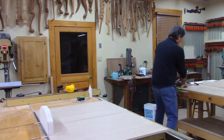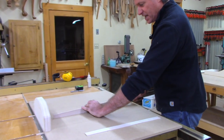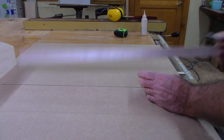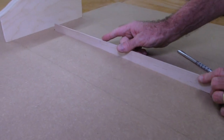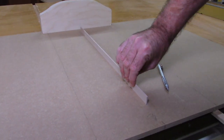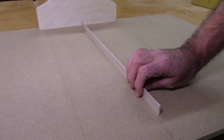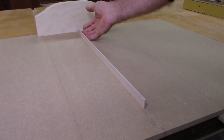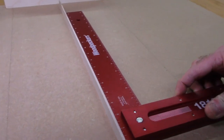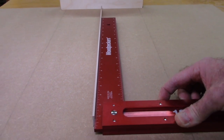Now I've got a little insert that was already sanded - it fits snug in the kerf, going in a half inch and up about a half inch above. It's a piece of curly maple scrap, pretty rigid. It's giving me a fence that I can square off of to set up my main fence. And look - this is where the square is amazing. It's registering very positively right against the insert. If I get my fence lined up here, I'll be pretty much on the money.